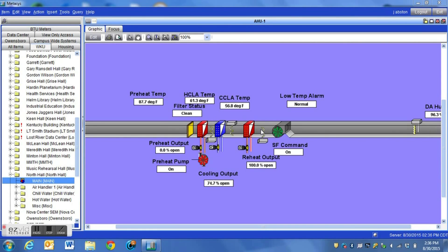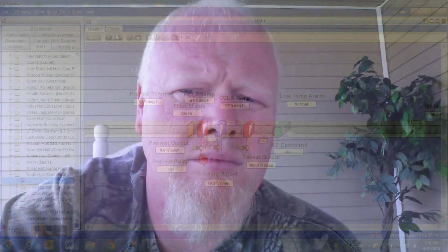That's the basic process of humidity control: you simply squeeze the air, squeeze the moisture out, and then reheat the air for temperature control and to help dry the air out even further.